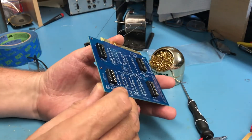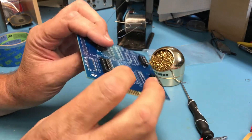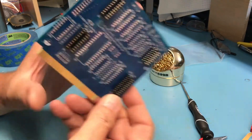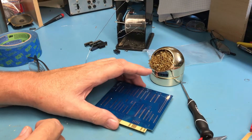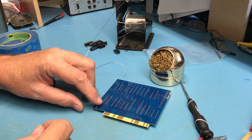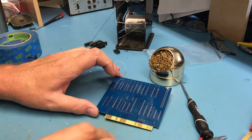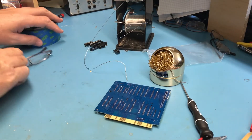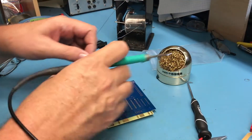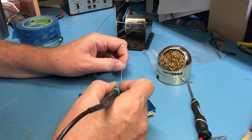The corners are tacked down, the sockets look flush, and the notches are in the correct direction. I'll mention this — I solder the corners first because that gives me an indication I have the right size socket. If I had accidentally put a smaller socket in and went to solder that upper corner, there wouldn't have been a pin there, giving me an idea I'd put the wrong size in. In this case everything looks good, so we'll just go ahead and solder this up.